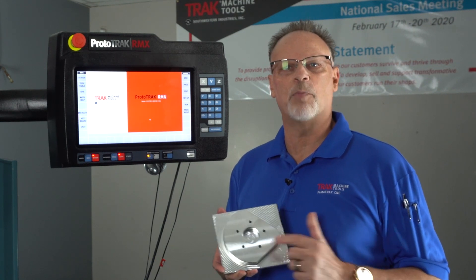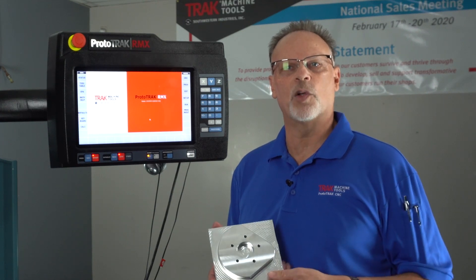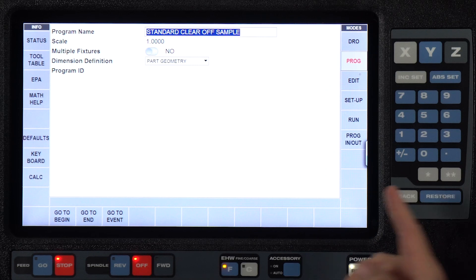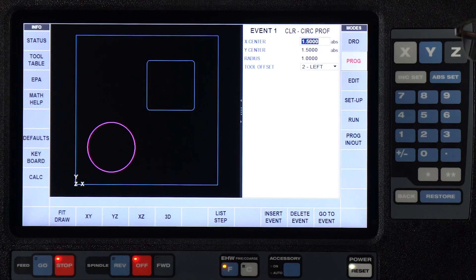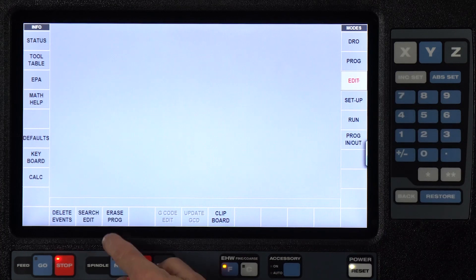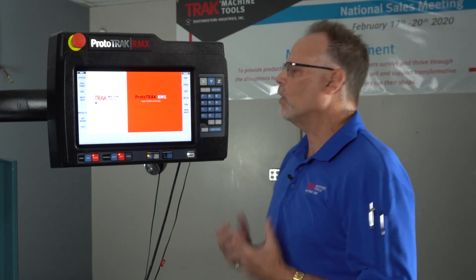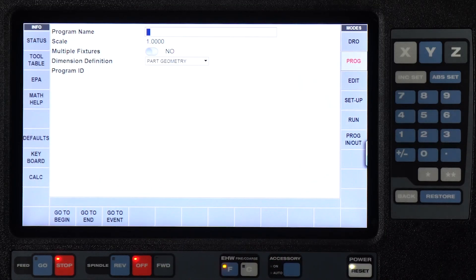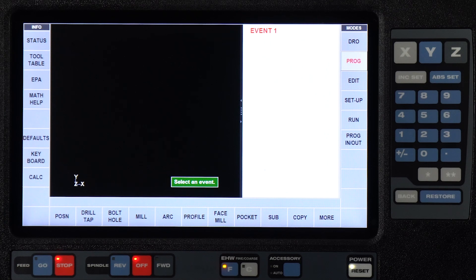Because we've used this product and this part in so many different times, we're going to use some different ways of showing you the ability and capability of how this thing works. To get us started, I'm going to start out with a simple sample. You'll notice in here if I go in the control and just simply swipe forward, I've got a part in here that's got a circular boss, a square boss, and an outside shape which is also square. I'm going to show you how to program this from scratch. The first thing I'm going to do is go to the edit mode and just erase my program. So here's how it works when you're programming manually. When I go to the program mode, it's going to ask me for a part name, which I'm going to skip for now, but normally you could put that in.